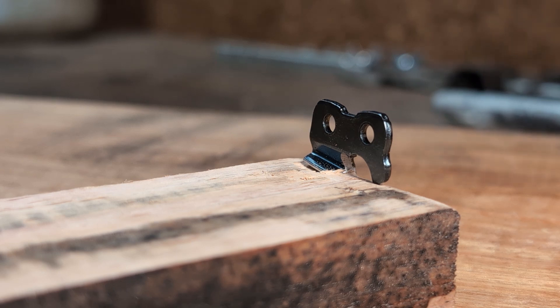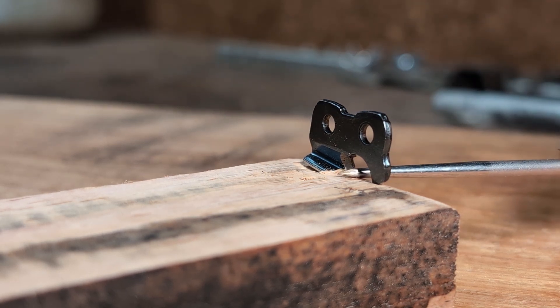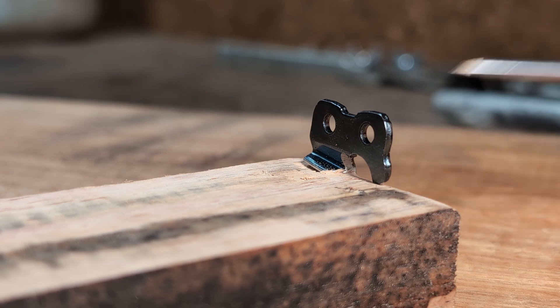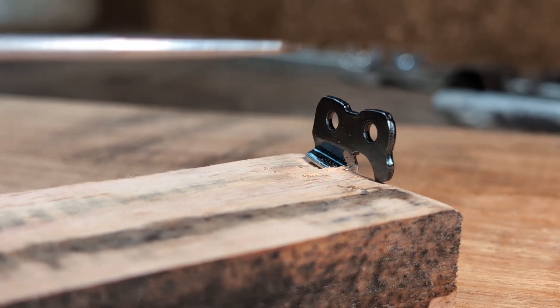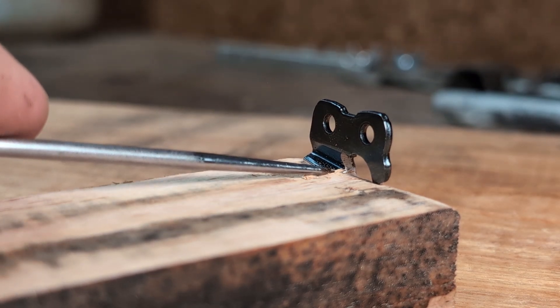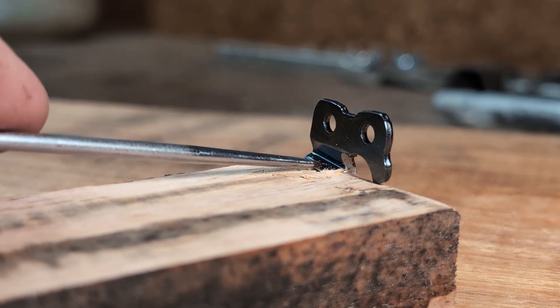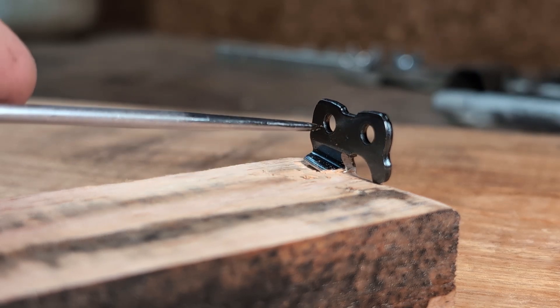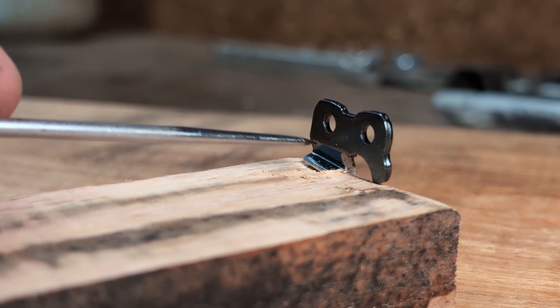It is interesting to see how it starts pulling the chip up through the inside. When viewing it from this angle we can start to see what the top plate cutting angle does on the underside of that top plate - it effectively works as a wood plane. The leading edge on the outer corner severs that fiber and starts breaking it away. The top plate cutting angle is responsible for digging into the wood and starting to plane that chip out. What we should see in action would be this chip starting to form and flow back through the chip channel - that section is called the chip channel. The chips flow between the underside of the top plate and the upper part of the drive link.